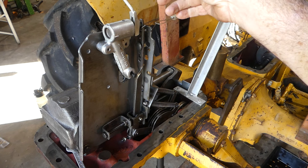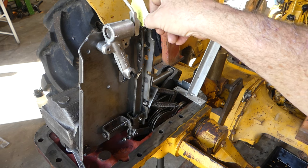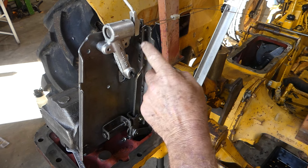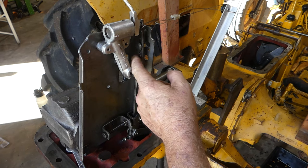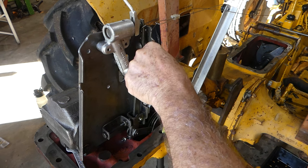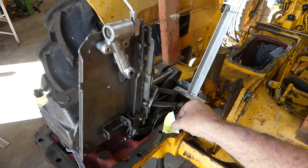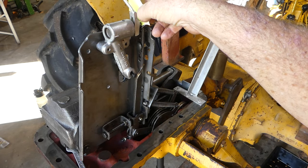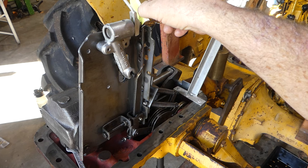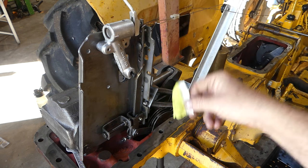You've got to think about what these adjustments are doing. By having such a fine adjustment here, they're just making sure there's an air gap so that this plunger has no effect at this present time. I'll just cycle it a couple of times then put a bit of paper in again and make sure nothing's changed. I can slide it in but there's enough pressure there that it just holds — that's great, that's all we need.